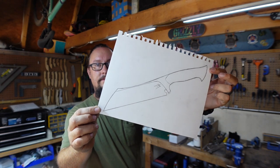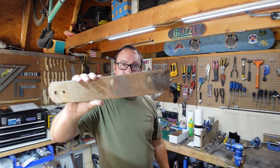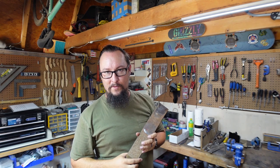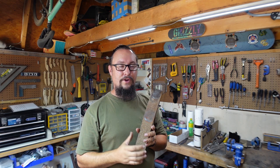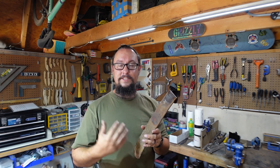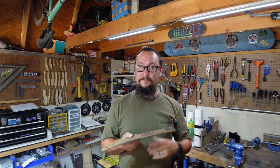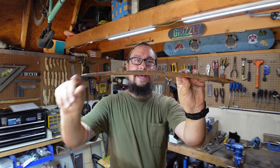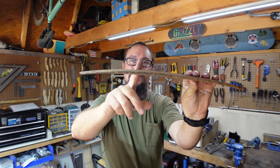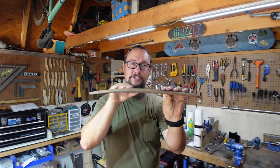That profile was a stress relief design. We're going to be taking this piece of steel right here, which is a piece of leaf spring — that's 5160. If you're ever wondering what steel you have when it comes to leaf springs, all you need to know is the year and make of the vehicle you're pulling it from, and a quick Google search will tell you what they were making leaf springs out of for that year. I know for a fact this is 5160. Now we've got to flatten this out because it has that leaf spring curve and a taper at the end, which I'm going to utilize on the tang side.